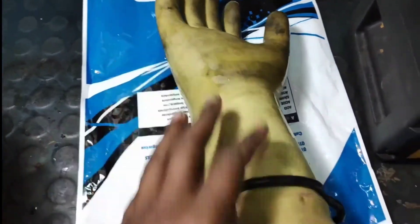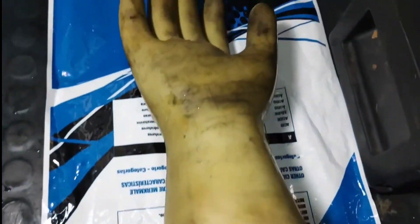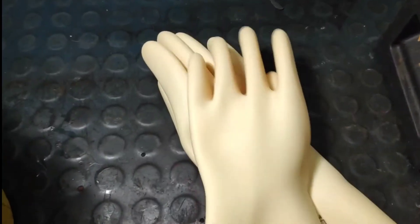Who is going to work in high voltage — these gloves can withstand a maximum of 1000 volts. I am working on 440 volts, so 1000-volt gloves are sufficient for me. This is how you check them.